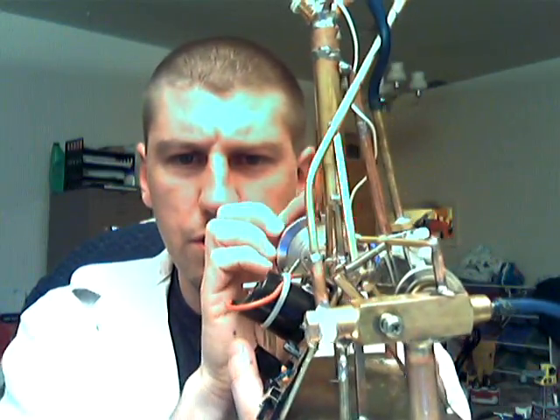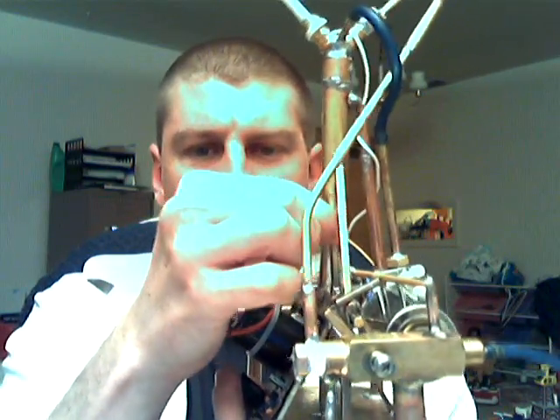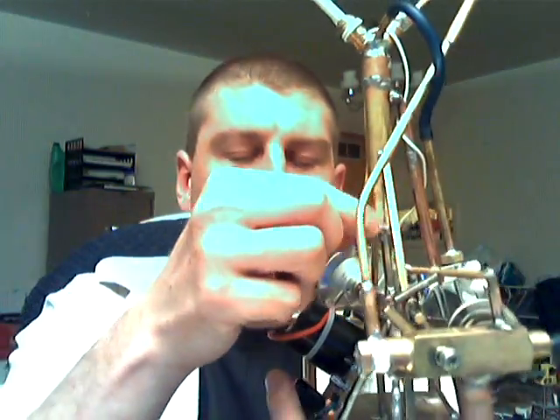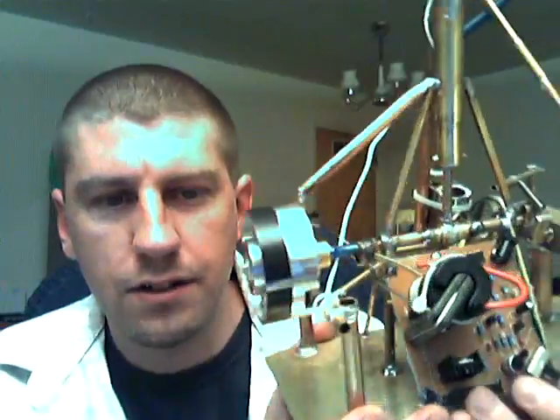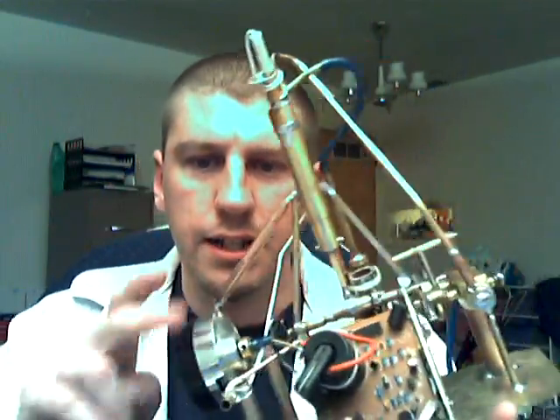I do not like how small my piston stroke is. I didn't want it to be a really big stroke because you see how this bar is at an angle — that'll induce sidewall forces on this brass piston and it would bind it up. I know it will because I did a test before I even started: I tried to push the piston in at a strong angle and it binds in there. I need to get like an RC car nitro engine or something and modify it to build my own piston. But like an idiot, I don't have any money, a job, or tools.